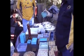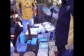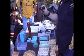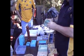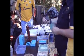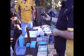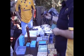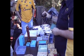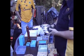I've been using this for 6 years and it's still going strong. It's getting a little bit brittle, but basically fill it up, give it a tap, and out comes that size. Now that for me does 3 blanks quite easily. You can do, if you fill it right to the top, 6 smaller ones, 6 small half tanks. But I don't bother, I just go for 3. That's actually brass filings that I got off the metal lathe when I was doing some new centres, and that'll be basically 3 perfect 22mm square blanks. So, and again, it just sits in there like that.